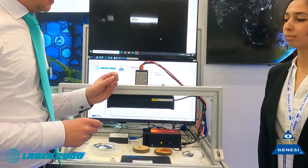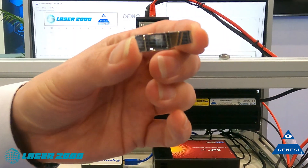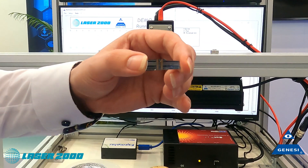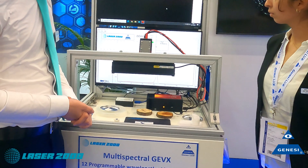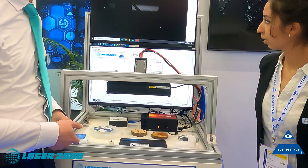Another sample for silicon inspection is bonded wafers. You can see the frame here, but on the back side it's nearly blank. When you put it under infrared light at a certain wavelength, even that becomes transparent. This again relies on the absorption of water or specific components in the infrared.